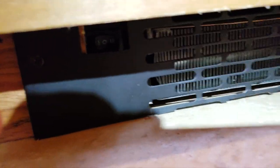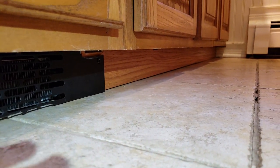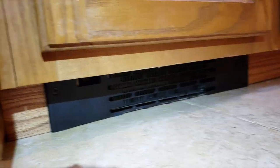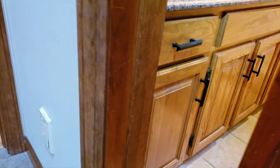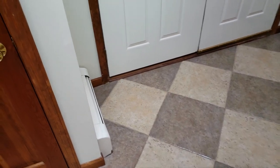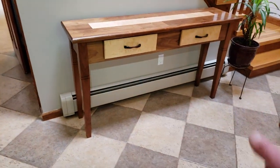I took three-quarter-inch plywood and made a toe kick, fastening it so it sticks out a little bit — but that's fine. The idea is that it's going to heat the bathroom, and most of the time we'll keep it partially open to deflect air out into the entryway, which isn't very warm either. There really aren't enough registers or ducts for this whole area.